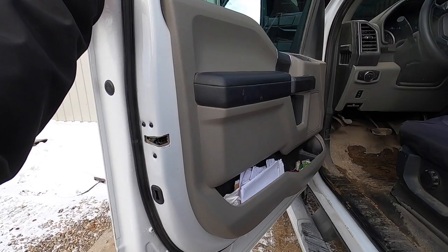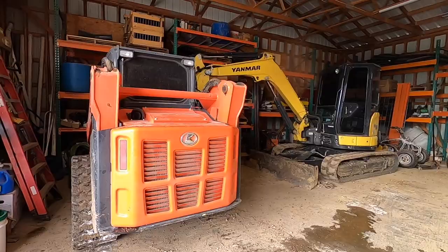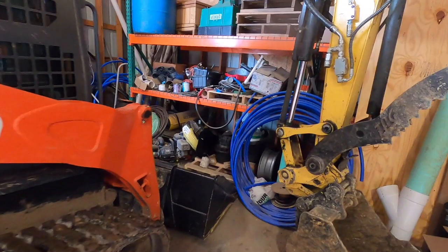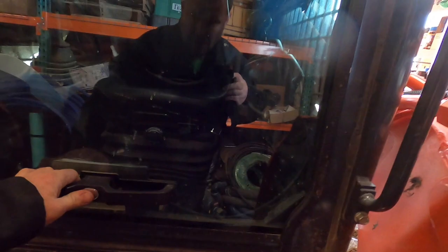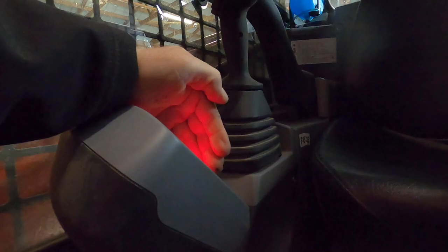We just got back from salting — the skid loader's been sitting in here for a couple hours. Let's check back in. It looks better. If you look at your fuel separator and it doesn't look cloudy, you're probably in pretty good shape. I apparently just made the mistake of not checking that and paid the price. Let's turn the key on — I just watched for the glow plugs to go off, the wait-to-start light — and she starts up.